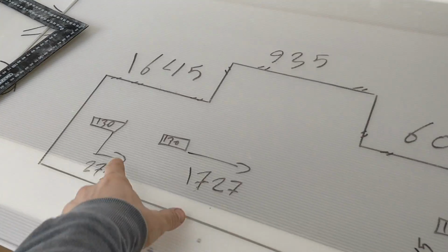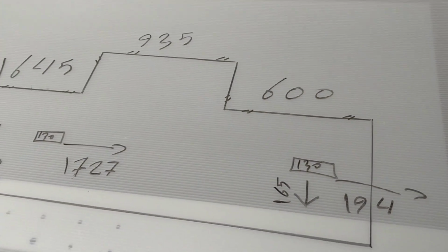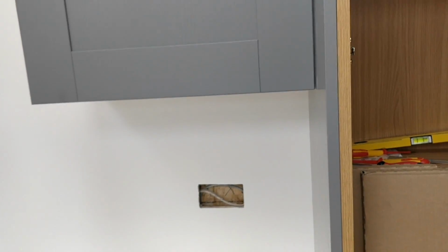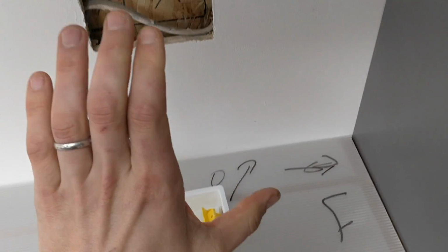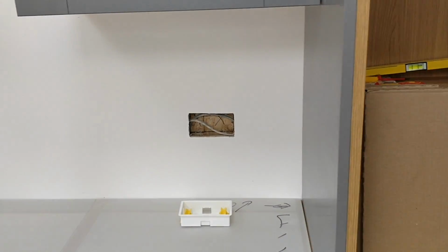So those obviously correlate with all of the plug sockets. My friend, you know the height of the socket, I make it all same. Perfect. It should be same height. Okay. So on this bit we're going to have the splashback coming all the way up onto here, which will be at the height of the extractor fan, and then the rest of them they're going to come up under here with the cutouts for that. I'll be putting these in first, and then the marble will cover it, and I'll put the face plates flush with the quartz.